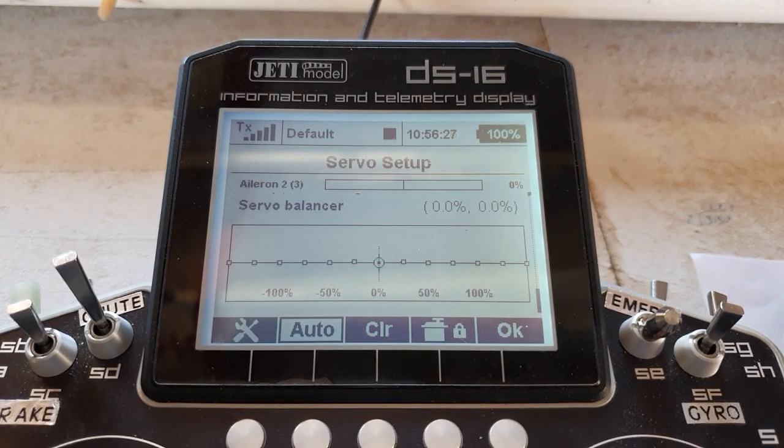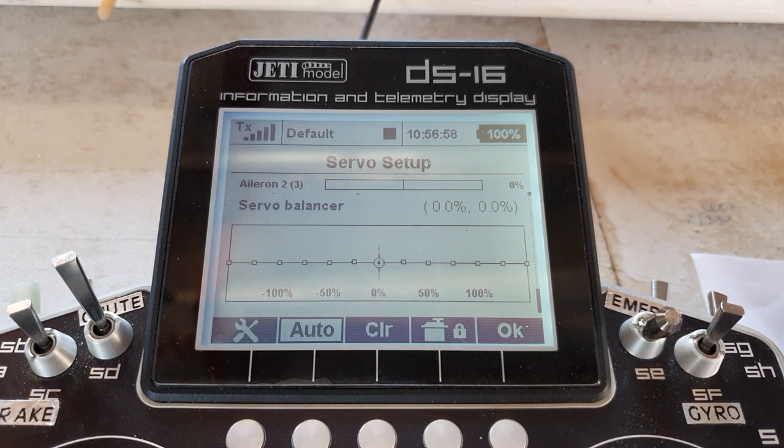And I went up another price point to a newish brand of servo to the UK, branded by one of the importers, which at least responded to a 1% change in trimming and always came back to the same centre. But two identical servos, one would rotate 88 degrees and the other would rotate 93 degrees. So you're going to have to adjust endpoints. Unless you spend a lot of money on servos, I'm afraid any ideas you've got of making fine-tuning adjustments here are just nonsense. Okay, rant mode off.